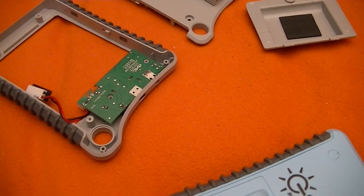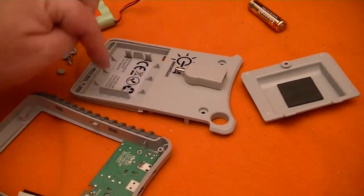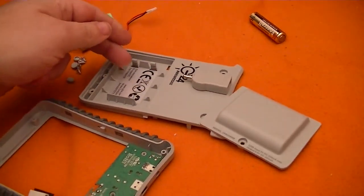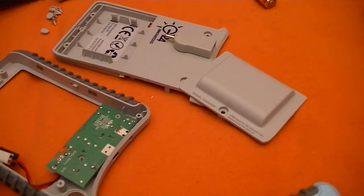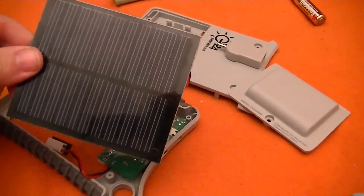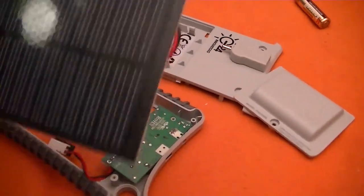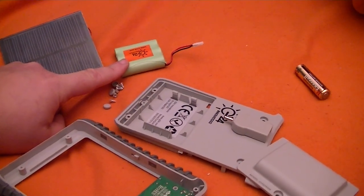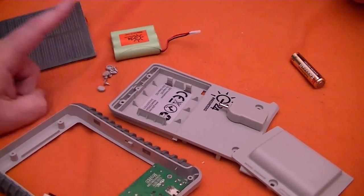Second thing I'd like to see done is to replace the battery pack with a battery holder. You know, a 3-cell battery holder, so that when the user unscrews this, he can simply remove the 3 batteries that are in there and put 3 of his own batteries in there. This does 2 things. This solar panel will probably last 20 or 30 years or more, especially in a non-continuous outside environment, like a person's going to use this. It's not going to sit outside 24 hours a day, so it's going to last even longer than your typical solar panel. Problem is, these batteries are going to last about 5 years. Tops, maybe 6 or 7 if you're lucky. But probably after about 5, the capacity is going to be too low to be usable. So you're going to want to replace it.